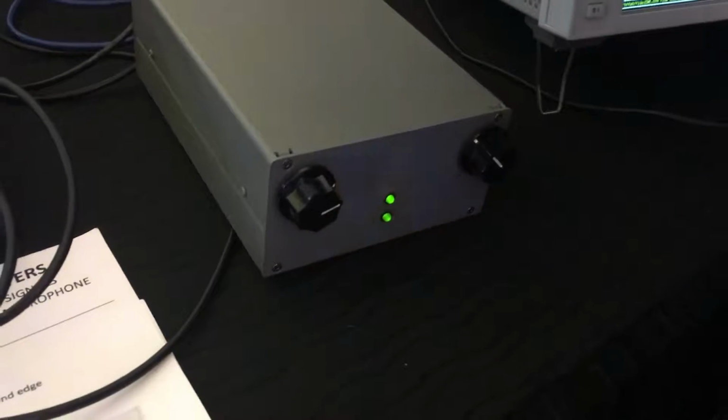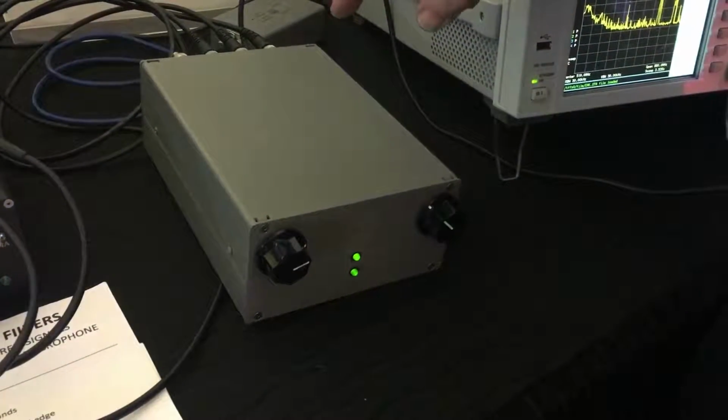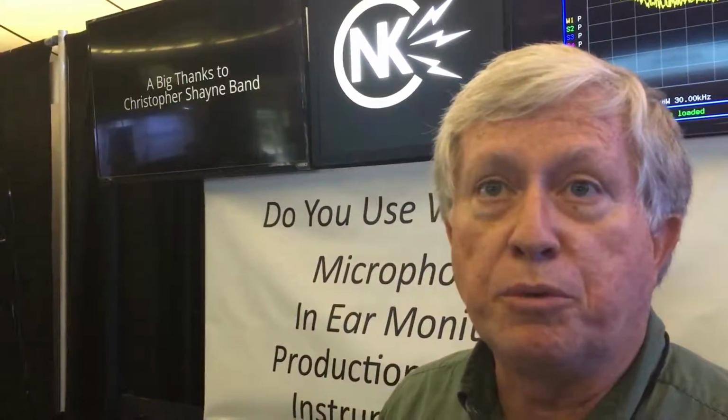This is our multiple antenna switch. You can hook up multiple sets of antennas, for example, in a condition like a parade or in a sports stadium where you have events happening all around, and you can use one set of receivers and route them to multiple antennas through our switching equipment. This also has variable gain amplification, so you can correct for long cable run path loss.